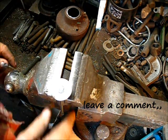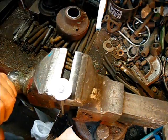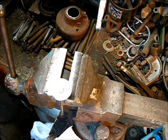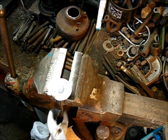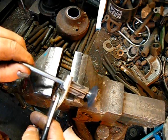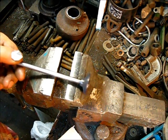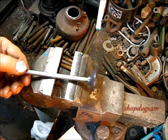Now let's get this valve out of the vise — remember that was real tight in there. Relieve it with the pipe, the stem there is warm but this part will be hot. Break it down and the two pieces fall off. We have a completed valve with the head affixed to it. I will cut them to length, and this particular one we'll cross-drill for a pin. Let's get the others done.